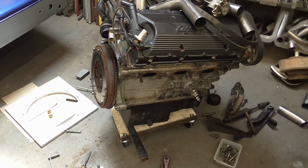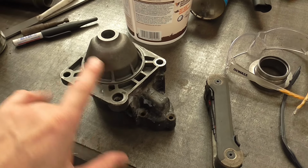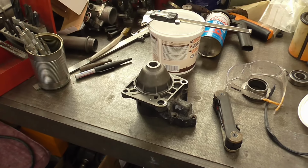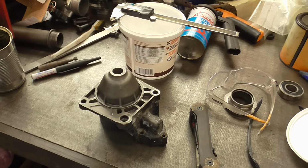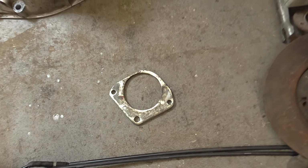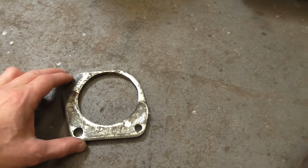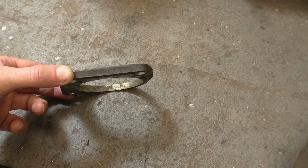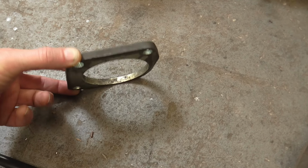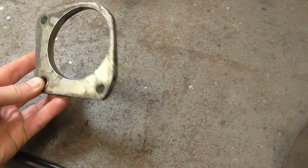And yeah, the alignment of the tapped holes in the plate to the bolt pattern on the starter motor was not good. There was also a spacer plate currently lying on the floor. I'm trying to work out what's going on with this plate, really. It's clearly been punched. You know, it's not milled out. You can see the shear line on it, although it has been ground back in places.